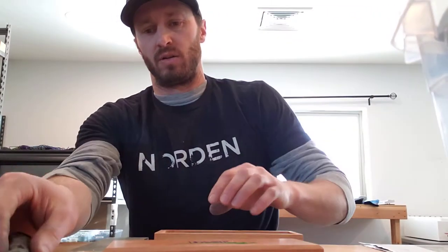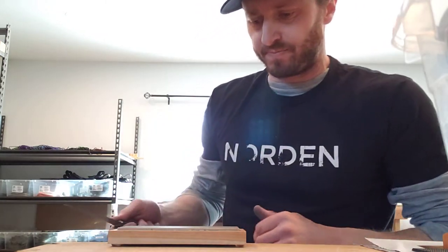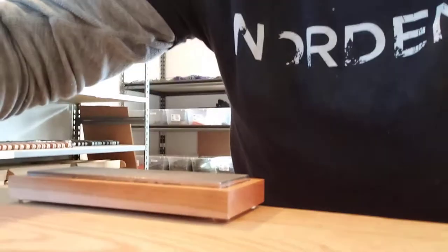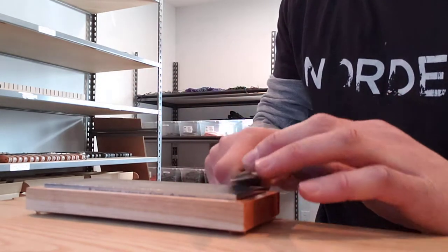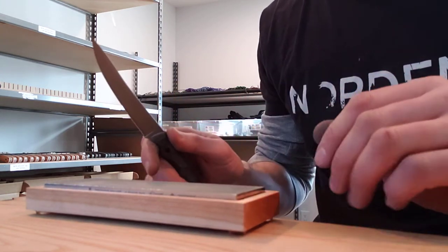Not sharp — so we're gonna get this bad boy sharp. I always start, if I need to sharpen the blade, with the heavy grits first — don't waste time — and then move up. For this level of dullness, I'm going to start with coarse. Lay it in here like this. Take your blade and lay it on there at about that angle. You can see the angle — hopefully you can feel it and see it. You're going to hold down with one hand and keep a flat angle with your fingers.